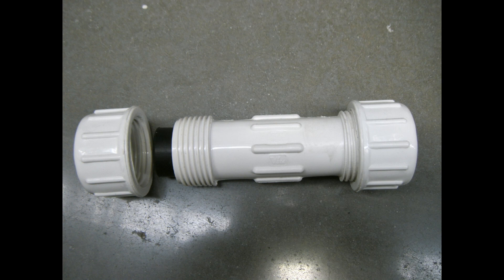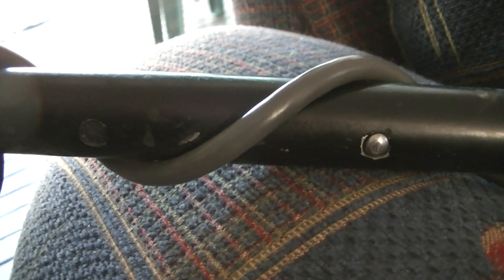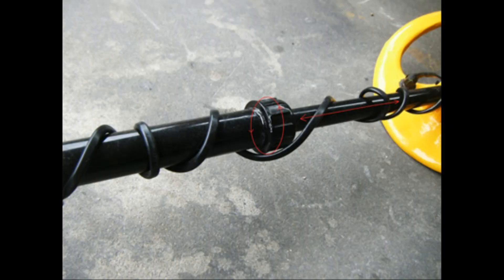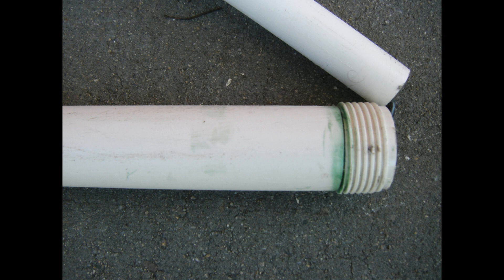The parts are easy to obtain, work well, and make a very strong and lightweight adjustable connection once cut and glued in place. Most detector manufacturers use specifically made tubes and a simple springy metal clip inside the smaller tube which locks through holes in the outer tube — a very elegant solution. But you can simply go to the hardware store, buy a pair of plastic water tubes which slide into each other and a tube joiner, cut the joiner in half, file or grind the end to fit inside the larger tube, and glue it in. There you have a strong, waterproof, durable, and adjustable twist-lock connection.